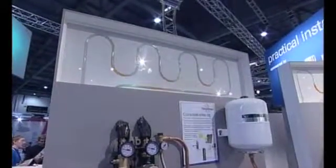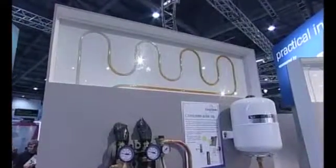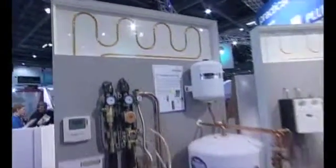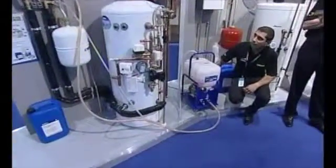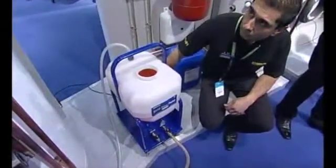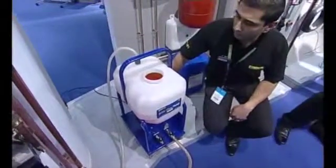Press the button. And you can see the air is being pushed out of our representation of a panel and being replaced by just fluid. We keep circulating until all the air is out — you can see because it's connected with clear hoses and also by looking into the tank and looking for any air bubbles. You keep circulating until you see no air at all within the system.